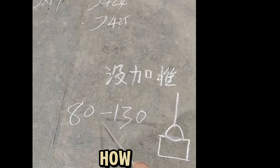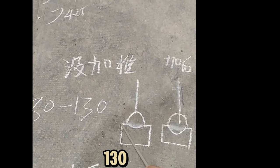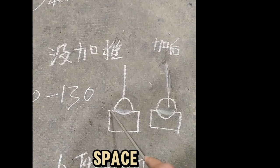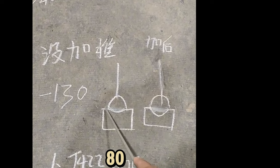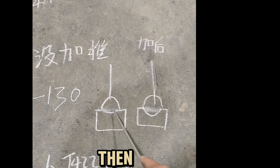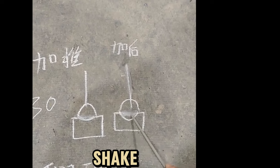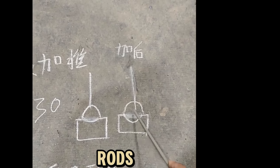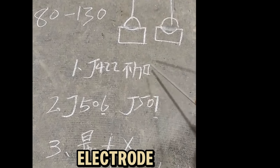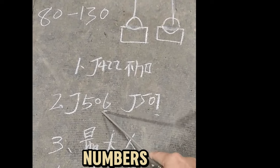For a small current of 80 to 130, we need to increase the welding thrust. Increasing the thrust increases the arc space. For example, if your welding current is between 80 and 130, without adding thrust the space may be about 1 millimeter. After increasing the thrust, the space may be 2 to 3 millimeters. Then when your hands shake, you will not have sticking welding rods. Acid welding rods like 42 series don't need added thrust because they don't stick. We only add thrust for basic electrodes with tail numbers 6 and 7.